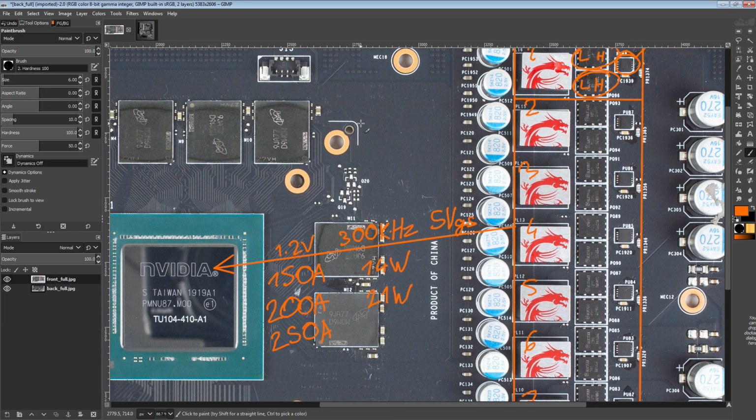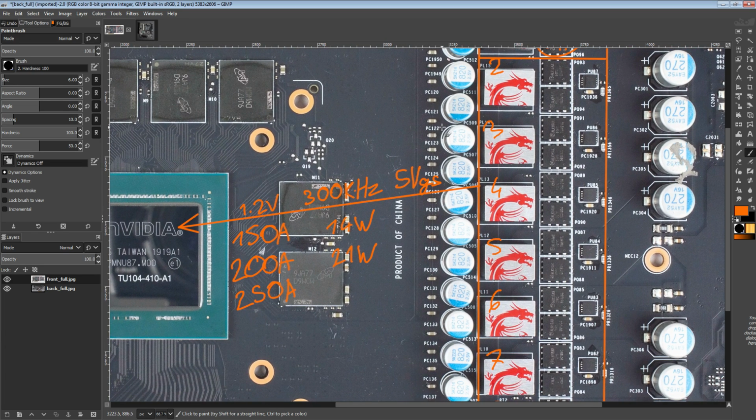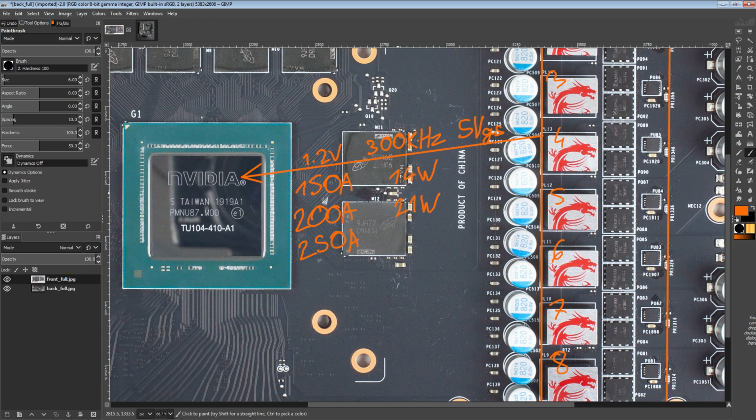With cards like the Gaming X, which is one of the nicer cards you can get, you basically get the same level of performance as the reference cards, because those are already relatively nice, and it doesn't really make sense. You could make something more expensive, and you can make something cheaper, but if you want something in between, you end up with something that looks a lot like the reference card this time around. For 10 series cards, that wasn't really true. Basically, anything for a 10 series card was an upgrade, except with the 1080 Tis. You could get 1080 Tis with worse than reference PCBs.